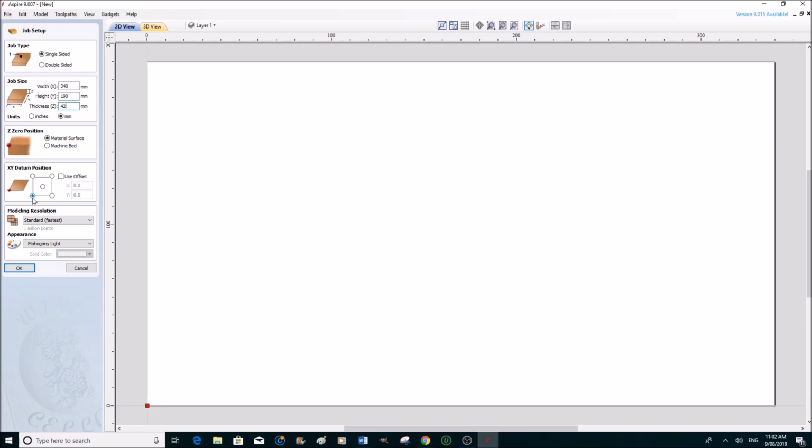Now start position, I'm going to put it in the center of the material, because I have added material on here, and it makes it difficult if I zero the machine just slightly off here. It does make it awkward sometimes if you're in mid-air. So it's easy for me to zero the position in the center of the material, because all I really need to do is get a ruler and draw a line from this corner to that corner and corner to corner, and it'll cross in the middle, and I can set my tool right there in the center. It's very easy to do.